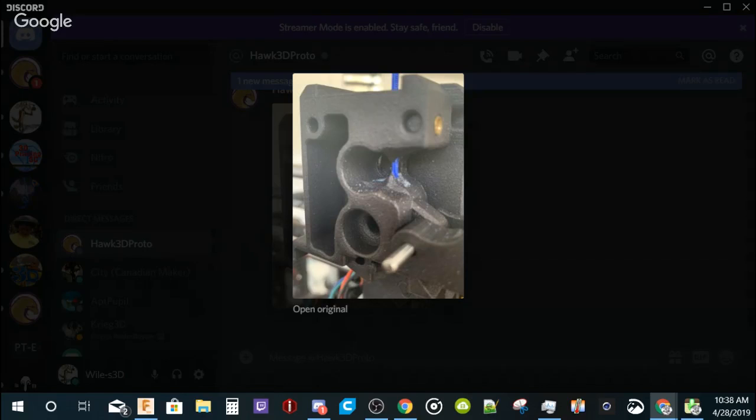Yeah, I bet you it gets bigger than that in some spots. Unless, like I say, all them shavings are getting stuck down inside there. But man, like I say, I'd heat it up through this hole right here. I figured you could see my mouse if I go up to that screen. Try heating it up through this hole here so the heat moves through here and not onto the filament as much. And it might be able to loosen that up enough to yank that out.